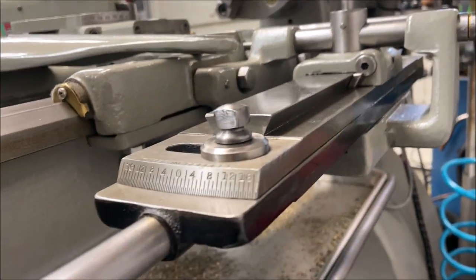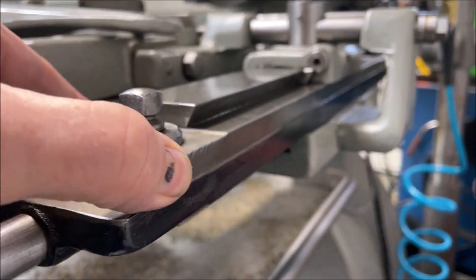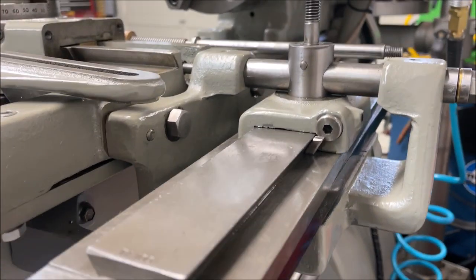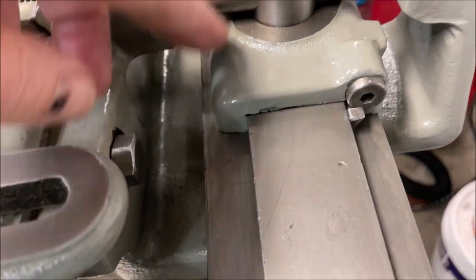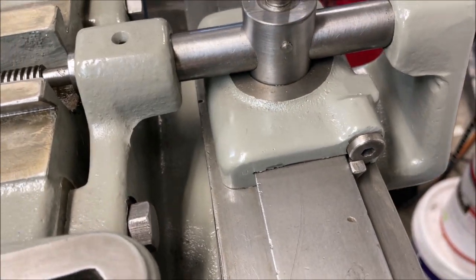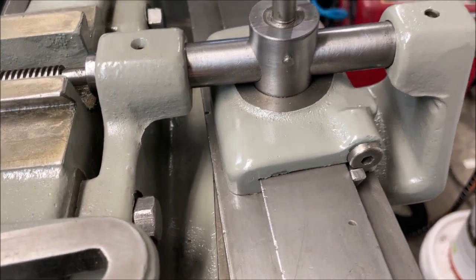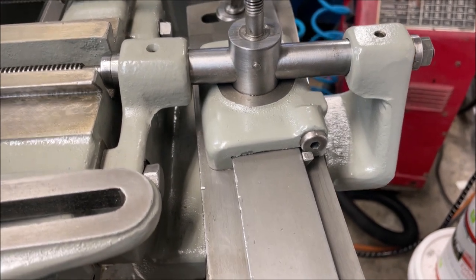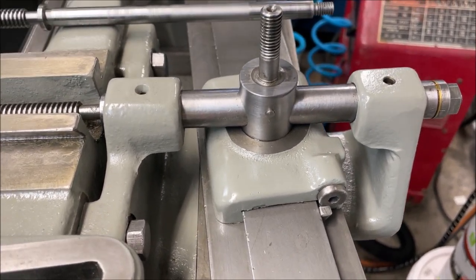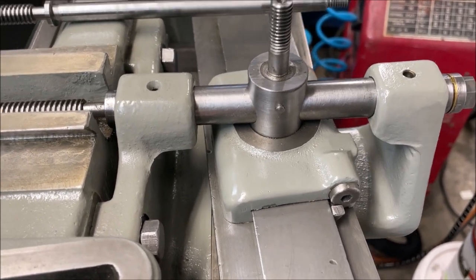And then your two plates, they've got a center pivot, okay? And that's what you're building right now. And the top one has its own dovetail. And then this guide block or anchor block has the mating dovetail. So when you're in the setup for a taper, and you're traveling along, that guide block changes your anchor point, and it just moves back and forth, okay?